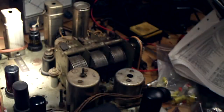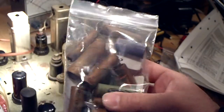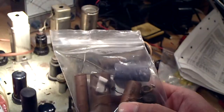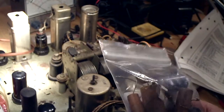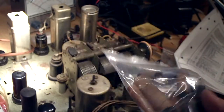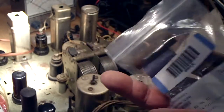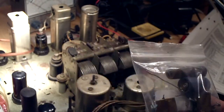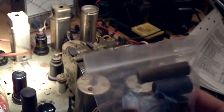Here's the parts list — it has every part in the radio, and you can get this on the internet, which is fantastic. About 60% of the original capacitors were the wrong values, because the radio is 70 years old and was repaired two or three times. Previous repairmen replaced the capacitors but didn't always have the right part, so sometimes a 0.005 microfarad was replaced with a 0.1 microfarad — they just put in whatever they had.